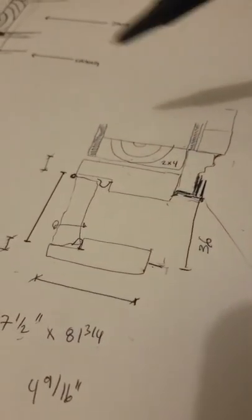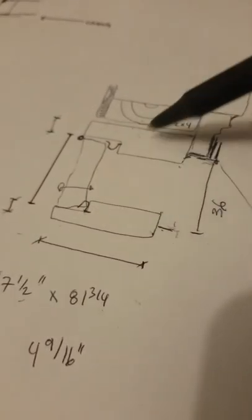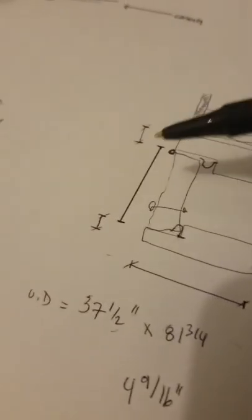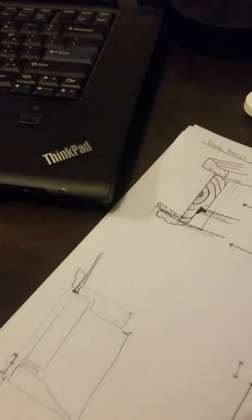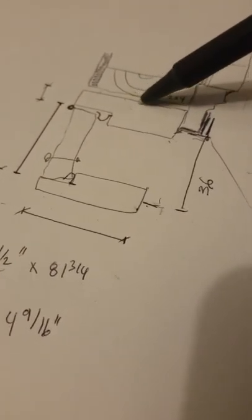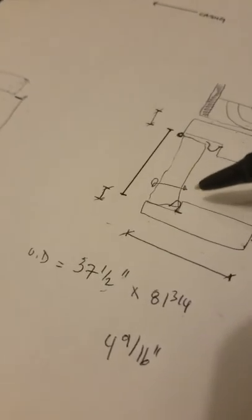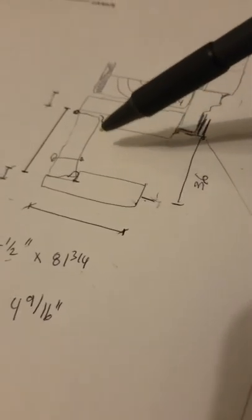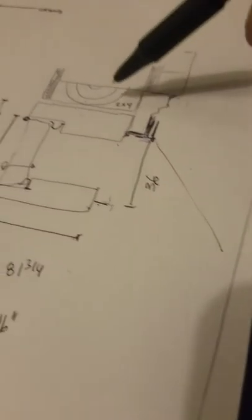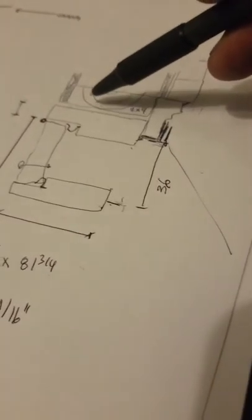You always want to use unit dimensions because that's what goes into the cavity between one jack stud and the other — mirrored on both sides — and from floor to the header, which is the horizontal member above the doorway, usually two-by-something lumber depending on structure, that cannot be altered. So we capture jack stud to jack stud, floor to bottom of header. Using unit dimension is best because a rough opening doesn't provide enough information — it could mean the masonry rough opening, the opening between jack studs, or an opening between finished drywall returns.